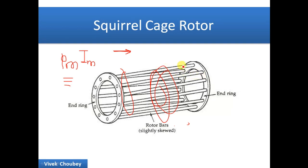Because the conductors are cutting at very high speed while at standstill, the inductive reactance of the rotor conductor also increases. We know that inductive reactance equals 2πfL, so it is directly proportional to frequency. The EMF induced within the conductor is of very high frequency initially, because the rotor is at standstill while the rotating magnetic field rotates at high speed. This high-frequency EMF causes a high-frequency current to flow, so the inductive reactance is high and the maximum current within the motor reduces.